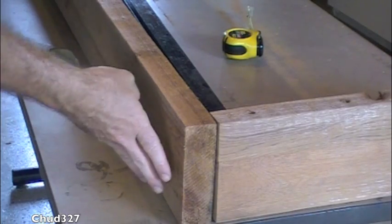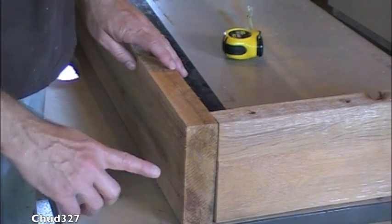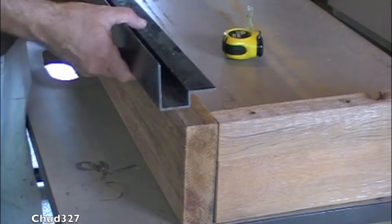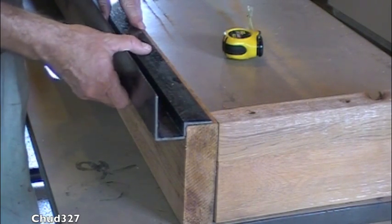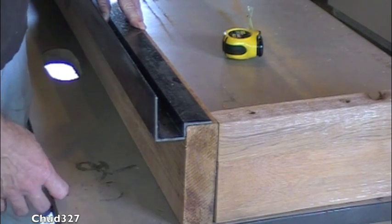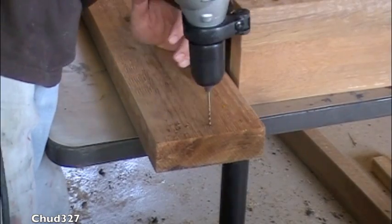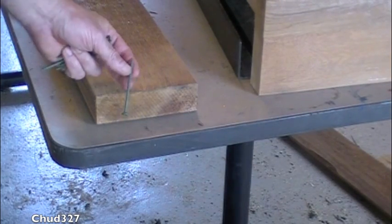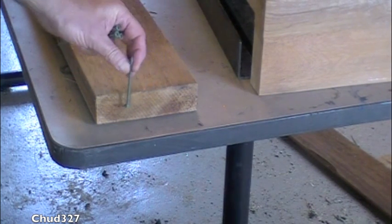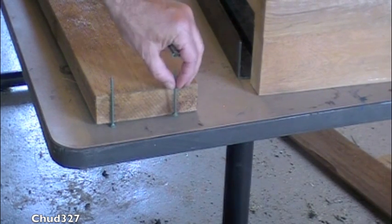On the countertop, I lightly sanded the front, getting rid of any splinters, and the bottom. The top of the mat will have concrete, so I'm about to drill three holes here, glue it and screw it. Then this is going to be the form — the plywood sits on top, and the form sits right up here like this. You pour concrete up to this level, after it dries you snap this front off and you've got a concrete countertop. I'm using three-inch decking screws — the same screws from episode one putting the floor together.